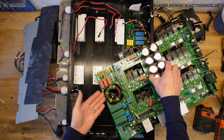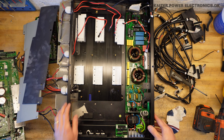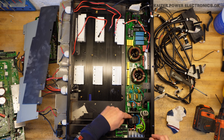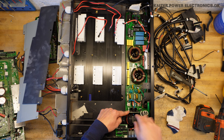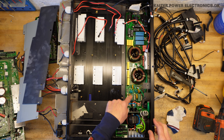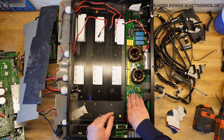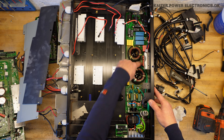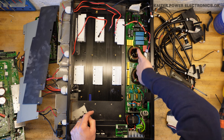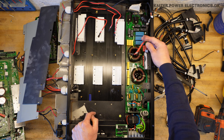I thought this was a combined filter, but this is actually just for 10kW of solar peak. And over here we have our mains filter. Seems like we have some kind of current transducer here — let's say fault current detection — because we have all three wires going through a single current transformer, looking for an uneven distribution between the phases. We have fuses, we have MOVs, we have capacitors, resistors. We have two filters, so maybe we have a common mode noise filter. We have two earth connections as well — a big earth wire. And the DC bus goes over here to a lot of different sized capacitors, so some kind of decoupling from the DC bus to earth as well.